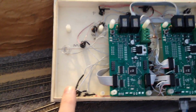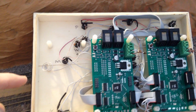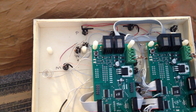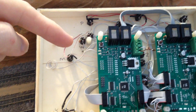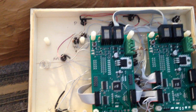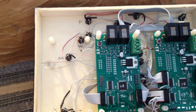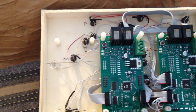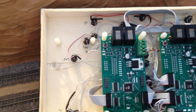And then I'm going to have a third board here, because with all the lights, I need 28 inputs, switches, 28 outputs for the lights, which are in the push buttons, which are for the route selection. But then I have another 30 lights that are going to show me the block detection, because in the front, I'm going to put red LEDs that tell me if the block is selected. So the push button will select the block, also indicate what the route is, but then the red LED will tell me on the panel if the block is occupied.